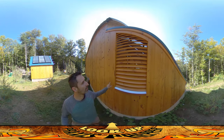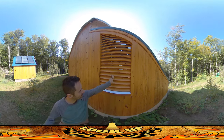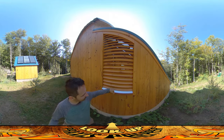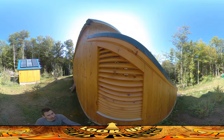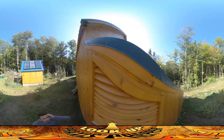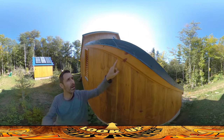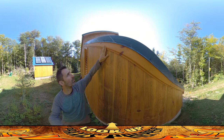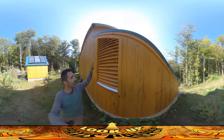You can see the frame is all around it. The one thing that's left to do — you can see the piece of flashing right here. As the rain comes down, it'll drip over the flashing instead of going down into the sill. I need to put one more piece that will tuck up and over the top piece of this frame, come out from underneath this piece of wood and go up and over the frame. But otherwise, this is done.